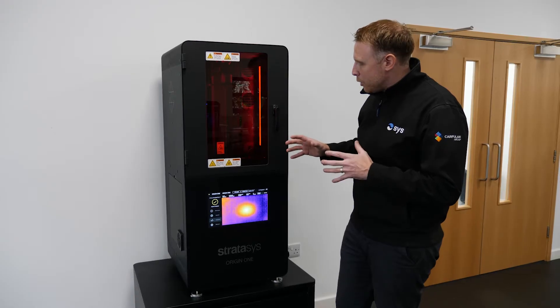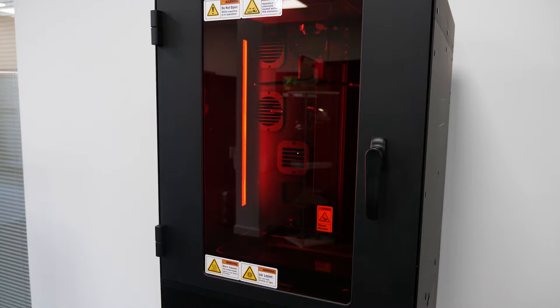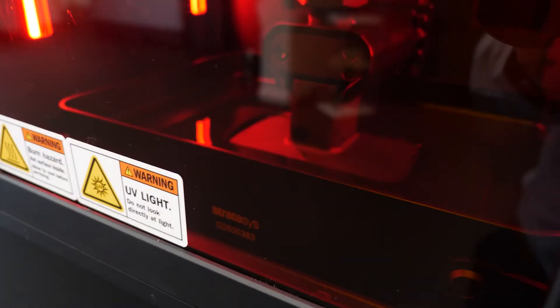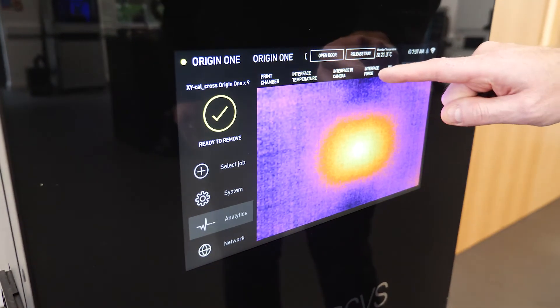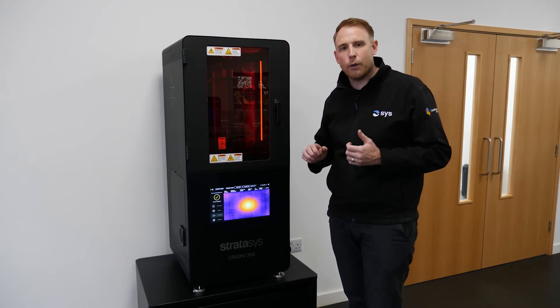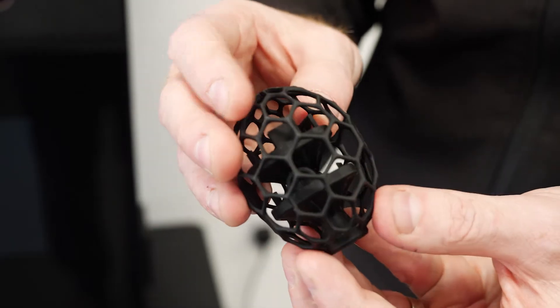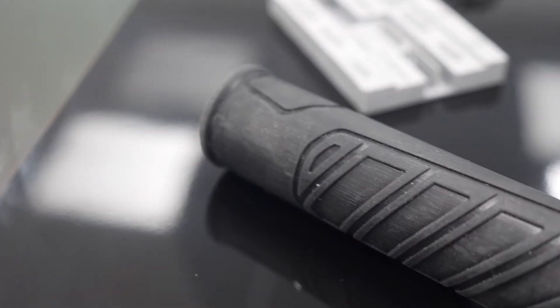This system is using an almost DLP style process with a lot of different features and sensors that allow us to print parts highly accurately with a fantastic surface finish. We're monitoring things like the temperature of the surface of the liquid, and we're also using pneumatics to measure the pull forces of the liquid. The part quality is outstanding, almost injection mould quality in many cases, with feature detail down to around about 50 microns.